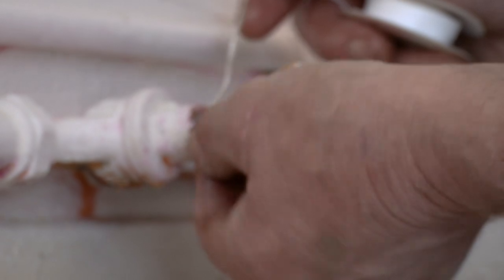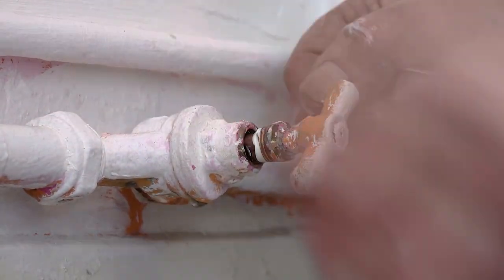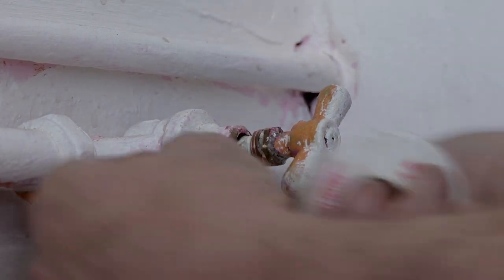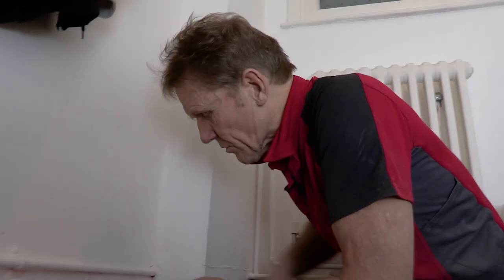Once I get it started I'll pull out of the way so you can see. Don't wind it in flat like you normally would to wrap a thread - wind it as a string, so just keep pulling it tight and wrapping it round. Once you've got a fair wodge in there, you need to just turn that stopcock off and start putting that gland back in. There's where you might find a problem because it's hard to get started sometimes. There's a nice good wodge there - don't skimp on it.